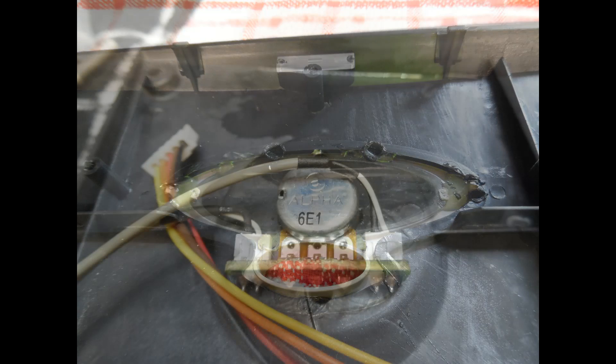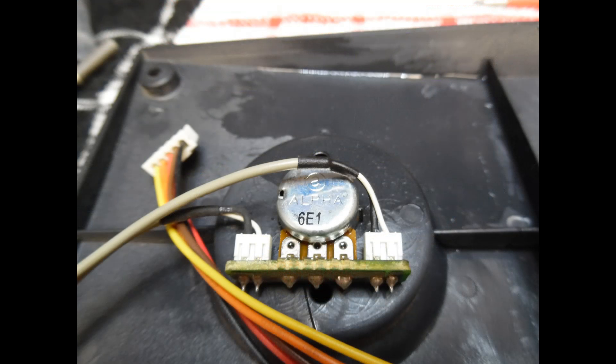The volume control potentiometers sometimes become loose. The good thing is you can remove the volume control knob — don't try and pry them off from the front. There is a hole so you can push them off from the rear, and then use the appropriate spanner to tighten them back up. Avoid using a pair of pliers as they can very easily slip and damage the shaft of the potentiometers. While the fascia was off the amp, I also sprayed high-quality switch cleaner — Deoxit — and rotated the potentiometers backwards and forwards to make sure they're nice and clean.